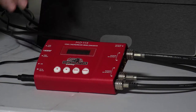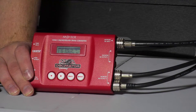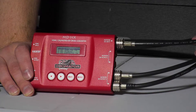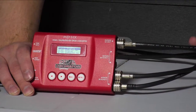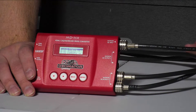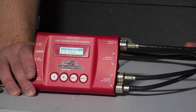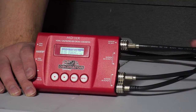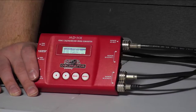Let's take a quick tour of the MDHX cross converter. It's got an LCD screen on it that allows you to navigate menus and configure the device. You can do all the configuration from the menus — you don't need any software and there are no DIP switches to worry about. Everything is done through the menu. The screen is backlit and it's actually showing that on the SDI input I'm inputting an SD standard definition 480i 59.94. HDMI input is not connected, and the built-in down/up converter is outputting a 3G 1080p 59.94 video signal, which is the video format I'm shooting in right now.